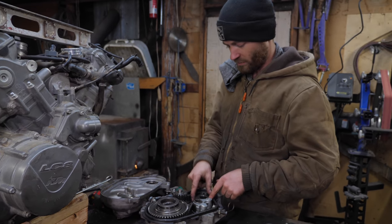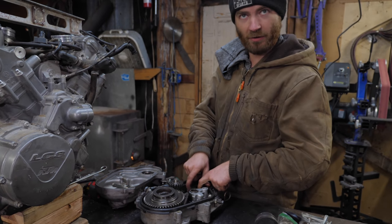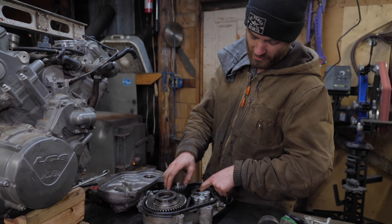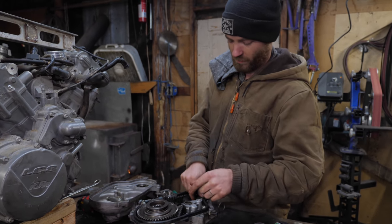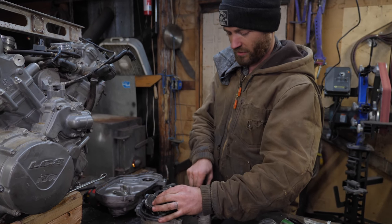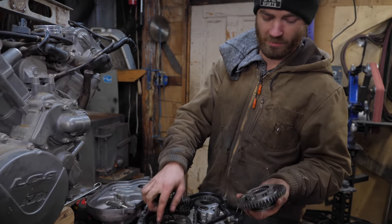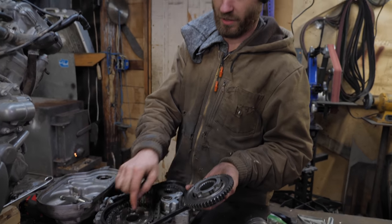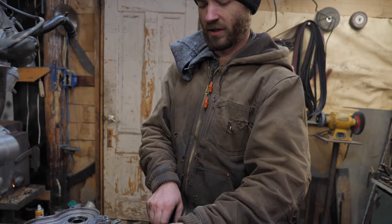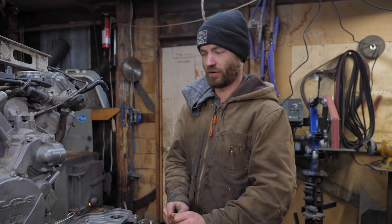Basically, most of the time you're driving the chain around like this, and they're going the same direction. And then you can see this extra idler gear here. So when you shift it into reverse, it just lifts this up and engages that, and then it's turning in the opposite direction, and it disengages this sprocket so that it can spin freely on the shaft. That's cool. Yeah, and then you're going backward. And the good news is this thing's designed for something that makes well in excess of 100 horsepower.